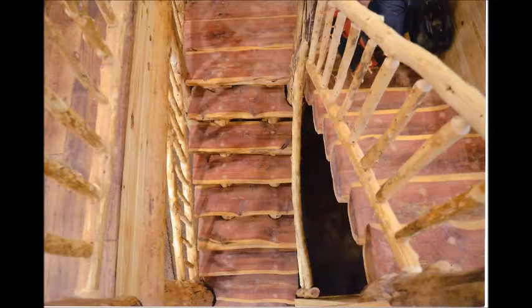The last thing before finishing is to retighten any of the lags that needed to be tightened, which weren't many, and plug all the holes. The bottom handrail on the right side had to go in around the upper handrail in order to connect to the same post. The stairs will have to be lightly sanded and a final finish coat of varathane semi-gloss applied. The rails will be done in a satin finish like all the walls.